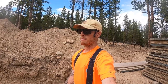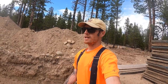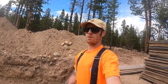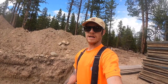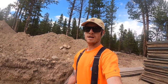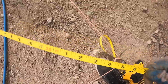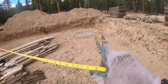So if I go into my handy dandy DeWalt calculator, because that's how Millennial does his math, the square checking for a footprint of a 30 length times a 24 width is a cross of 38 feet, 5 inches. 24, 30 equals 38, 5. We got our 38, and we're right on our 5. Let's check our other cross. Just checked that cross over there.